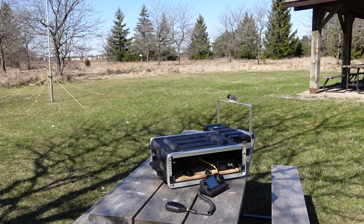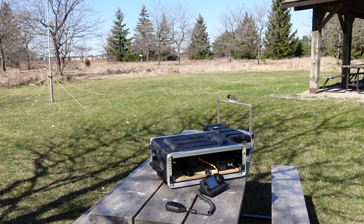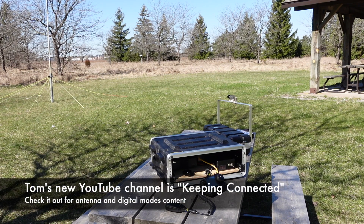The pile-up is growing. SWR was going up and down a bit — I think we need a choke somewhere. But it never blocked the radio — not even close. It's just working as you'd expect a 15-meter antenna to work. And here's the thing: a lot of people are using compromise antennas on 15, using tuners to bring their dipoles into resonance, which is a compromise, as opposed to something like this, which is actually cut for the band and gives optimum results on 15.